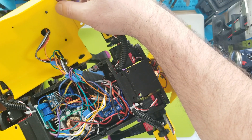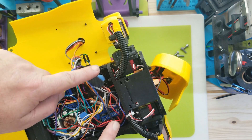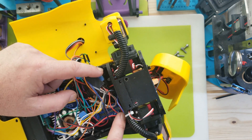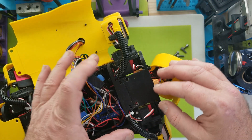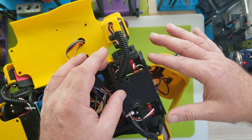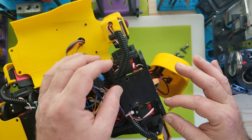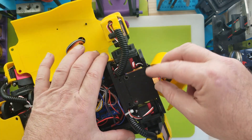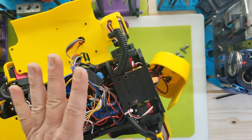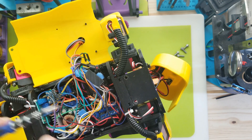Conveniently, you can often use her legs to hold up parts while you're working on it. To take off the rear end there are two screws in here holding on to each of the servos — those are the main screws and I've added Loctite to them. They are hex nut heads, which is important; I suggest using those because Phillips strip very easily and you want those really tight. The two plates of the rear end are held together with two screws here and two on the underside, so once all that's out we should be able to extract the rear end and get that motor out.